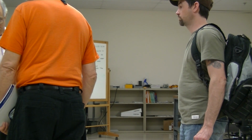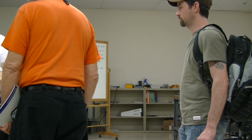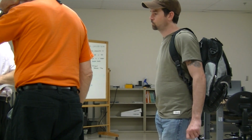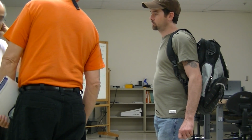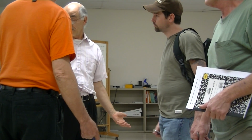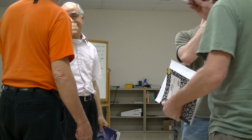And there's this tension meter, which I tried to get from Goodyear, and they wouldn't give me one. They're supposed to be about 93% accurate. It's a non-mechanical thing, supposed to be as accurate as the plunger. But these things are about $500. They're frequency meters. How much use do you get out of it to justify the cost? Well, I'm going to get 90% compared to 99%. I guess if you've got a ton of belts in your facility, and if they're expensive belts, like a lot of the expensive positive drive belts, then maybe.